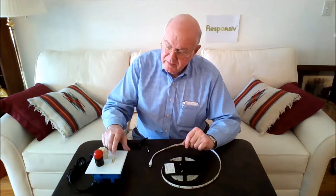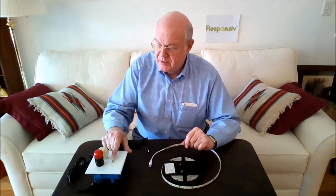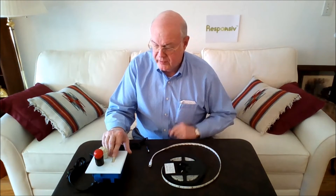It recently sold on Amazon.com for $9.49 and appears to be representative of widely available designs on the market. We have a little fixture here with a Lutron model TG-600PH triac-based dimmer. This dimmer is marketed for use with incandescent bulbs, although more expensive dimmers marketed for compact fluorescents or LEDs should work similarly. The output of the triac dimmer is wired to a couple of electrical outlets.